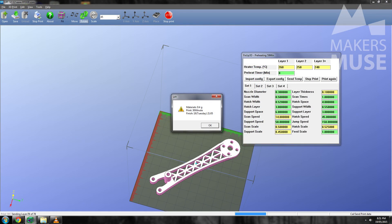For those who don't know, the UP actually runs at a higher temperature than most other printers for ABS. It runs at more like 260 to 270 degrees, which is usually too hot for ABS, and there's been a big sticking point for people with UP printers — they can't easily run aftermarket filament. So I wanted to see if this quality filament, because it's actually Japanese made, performs better.